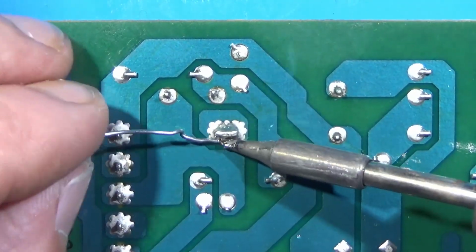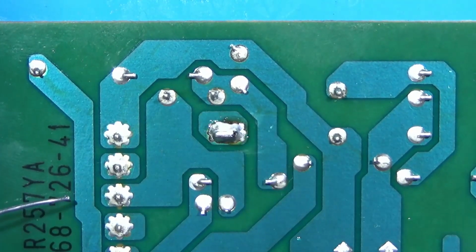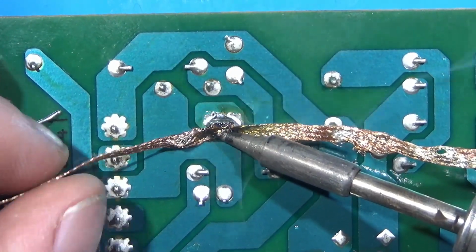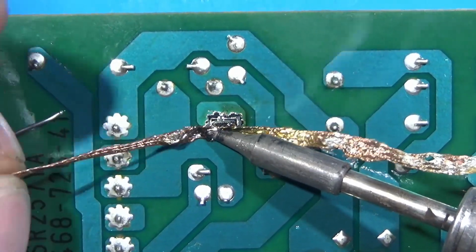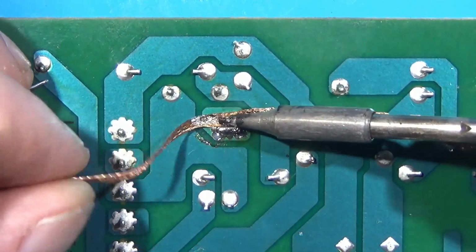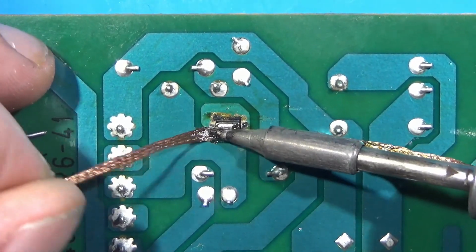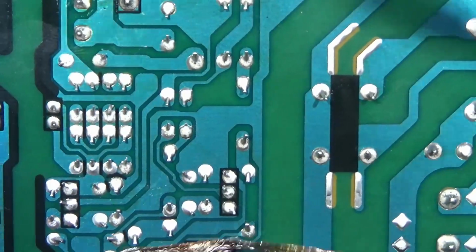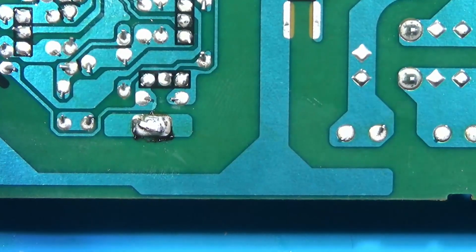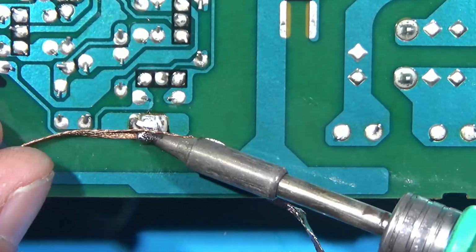So big ups to Ludwig over on the Pixel Effects Discord, who came up with this strat of just desoldering it and then snipping it. I've got these big metal cutting scissors. Just gave it a snip. So we've got 3 pads, and they're kind of bent, so this was installed and then these tabs were kind of twisted a bit, so it's kept in place before soldering. So I wicked it up and just kind of bent them back into place.